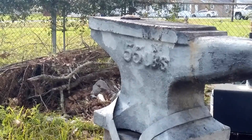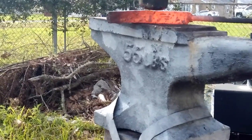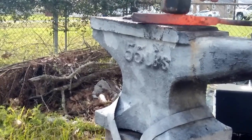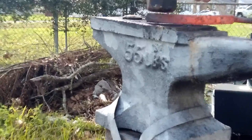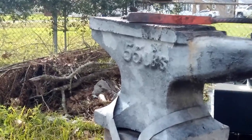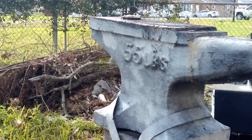Again, you always want to keep your anvil clean. Now it appears to be completely welded. I'm just straightening it up and looking for any small cracks or open areas. And there it is, ready to be drawn out into whatever shape you need it for the project you're making.